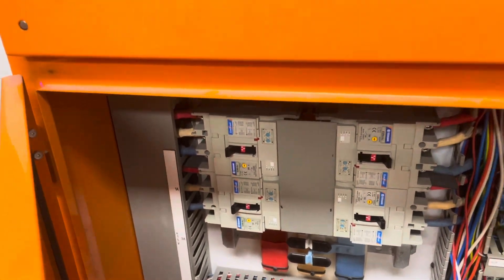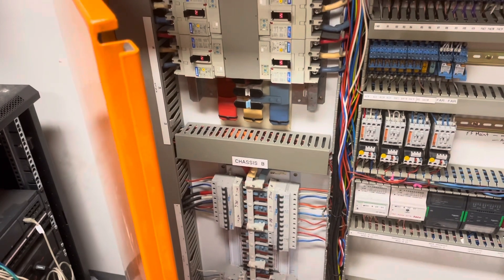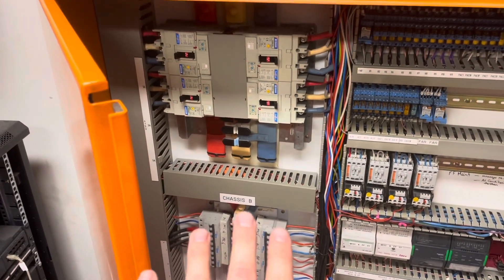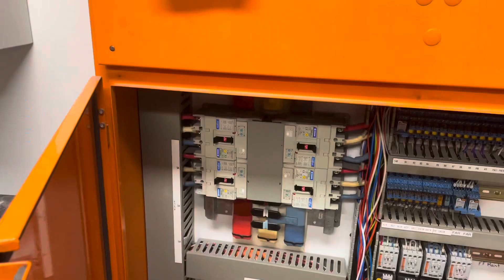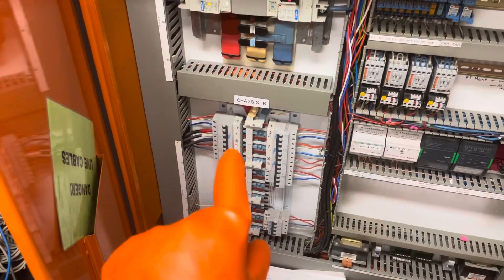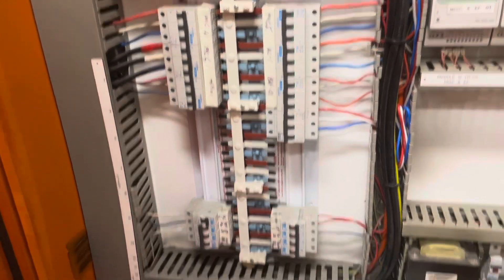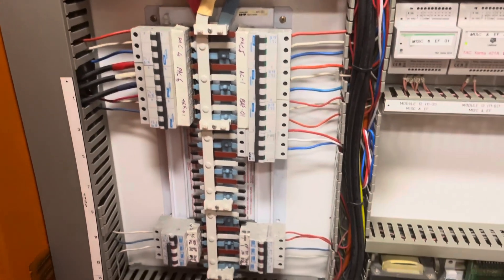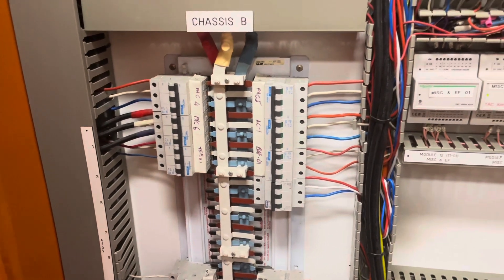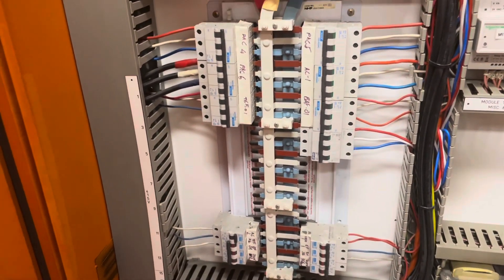Success. We did all the tests to confirm — I was 99.9% sure it wasn't going to blow up in my face, but it's still a little stressful. Now I'm going to go through and start turning these ones on. Just before I turn them on, I'm actually going to test just to make sure I've got all my phases and the power is correct. Cool — three-phase power is correct. We're going to go through and start turning on the breakers. I'm turning them on individually, because if the air con starts up it's obviously going to have pretty high current draw. If you whack them all on quickly in succession, there's a chance it might trip again. So one at a time, let it sit for 30 seconds.